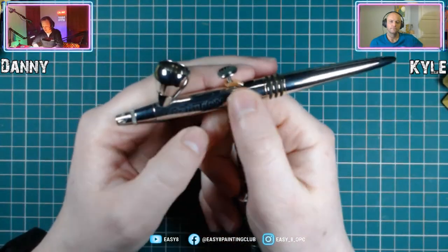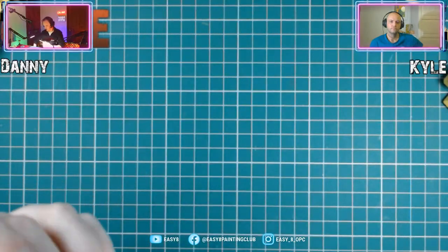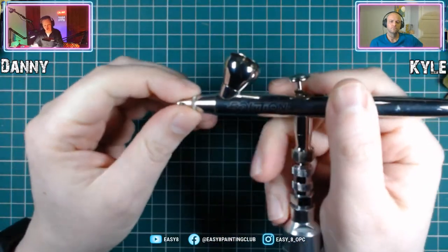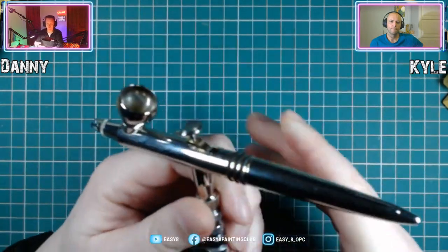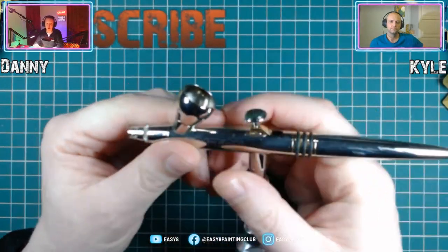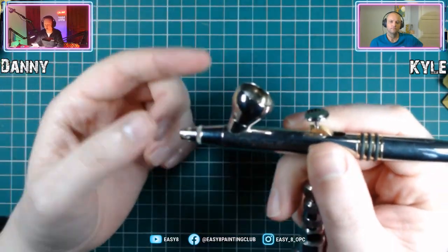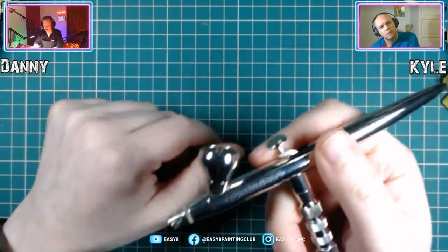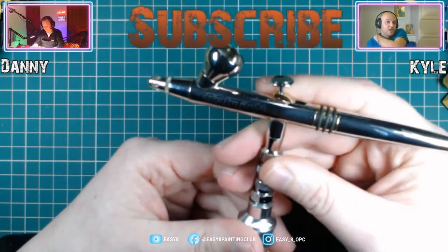The standard accepted phrase is like milk, so you want it to have the same sort of consistency as milk. If it goes too runny, it's just not going to give you a really good coat, and it probably will run and just generally have a really naff appearance when it hits the plastic. Too thick, and it's going to struggle to get through the nozzle, it's going to cake up inside, it'll dry, build up, and it'll block very, very quickly. And it will spatter, and there's all sorts of different things you can get: spatter, spider webbing, and it just all kind of gets away from you. I assume you don't actually use milk, though.